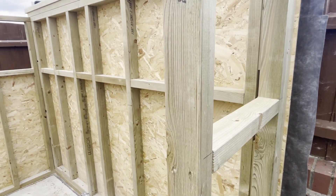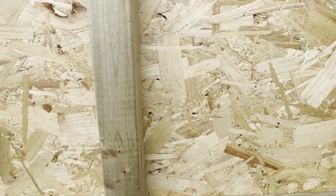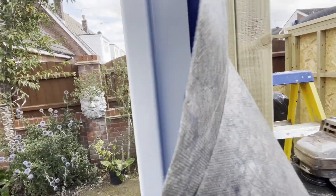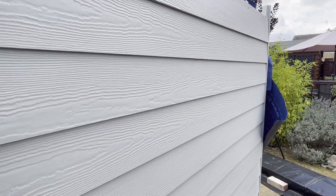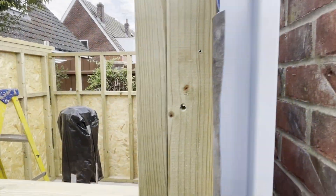The construction of the observatory so far is like this: there's a 3x2 treated timber framework with studs at 400 centres. Screwed to the outside of the studs is 11mm OSB making it all rigid. On the outside of the OSB is a breather felt, then over the top are 2x1 battens at 400 centres screwed to the main uprights, and then we have this light grey cement board — Hardy plank. I've used metal corners for a nice smaller profile, which makes it neat and tidy. I've ordered a door and I'm just waiting for it to arrive.